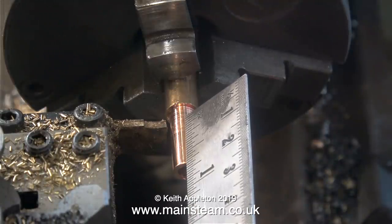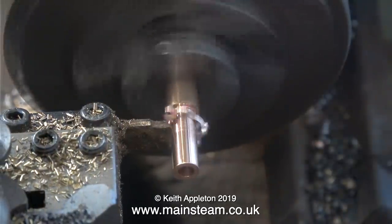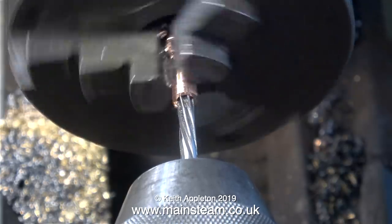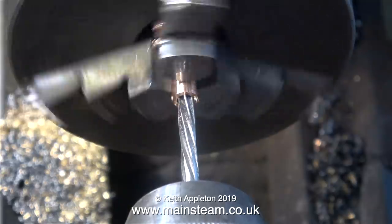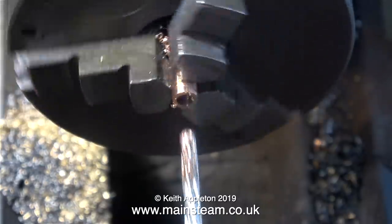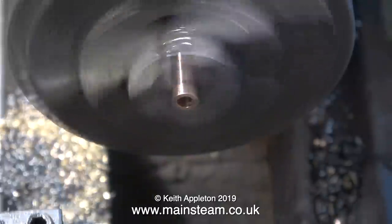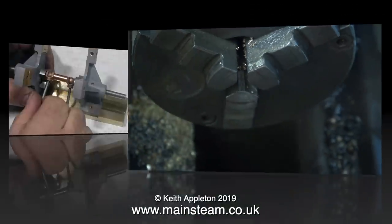The finished part by my calculations needs to be 5-8ths of an inch long. I should really have used the reamer on the original part while it was still in the chuck, because now it's not running 100% true — but it's not a precision component; this is just a fairly loose coupling for the two crank pins. Here I'm machining the end of the sleeve using a normal lathe tool, and of course, always remove the sharp edges.